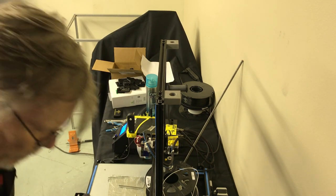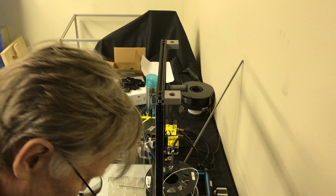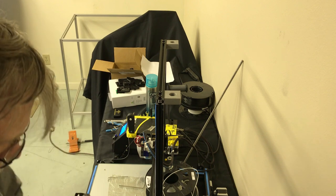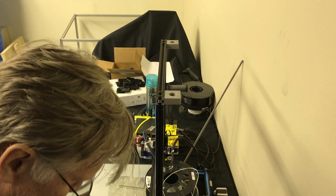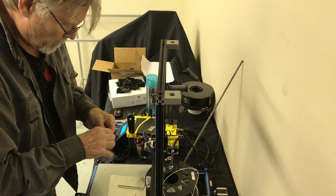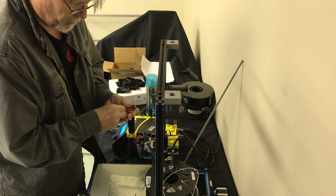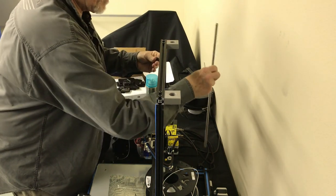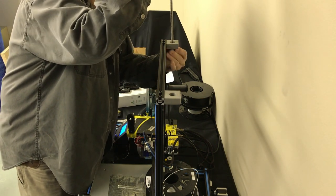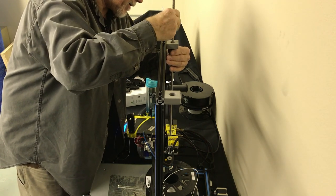Okay, in your kit, you will have 4 8mm by 16, I believe, flanged bearings. There'll be two on each side. You'll have two set collars, 8mm set collar. Open up that set collar. Okay. So in this order, first the set collar goes on, the bottom, then the flange. Thread them right through, like so. That gets threaded down here.